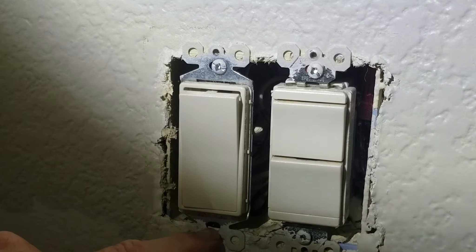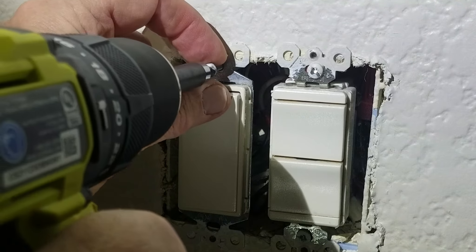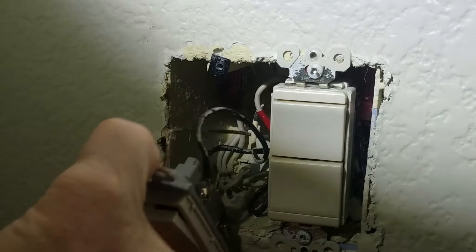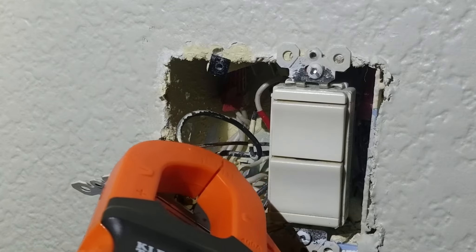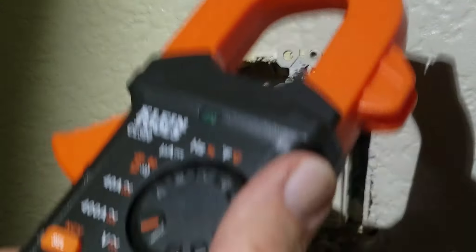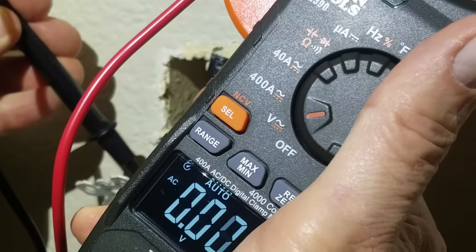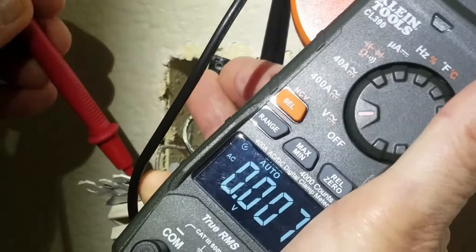It's good to remember which hole these screws went in - they go in a more oblong-shaped hole, not the round hole. Pull this out. There are the wires. Do another power test - it doesn't detect any power. No matter what the tester says, I'm going to double check with the voltmeter to make sure nothing's coming out. We'll check all the wires in every direction. Nothing - it's residual.